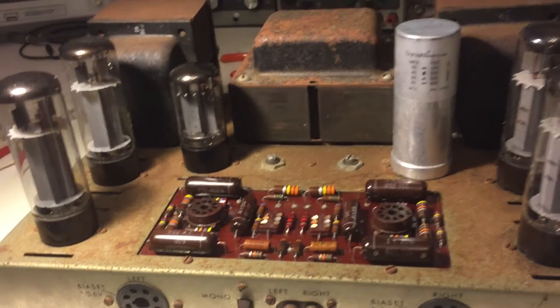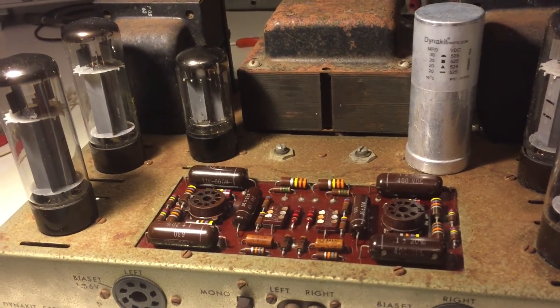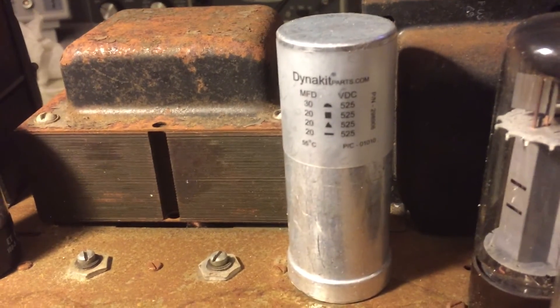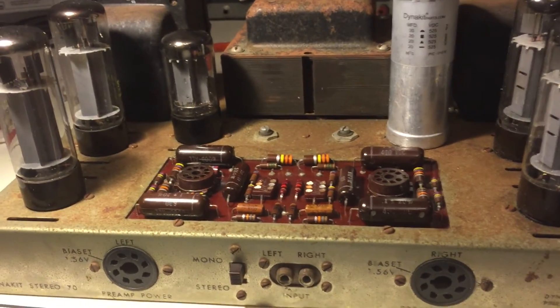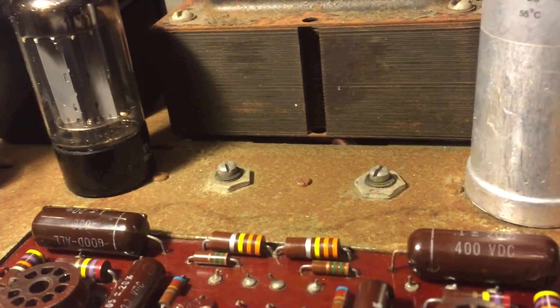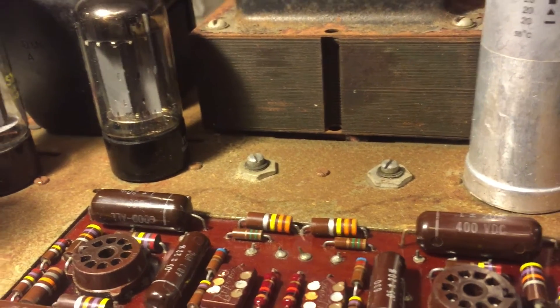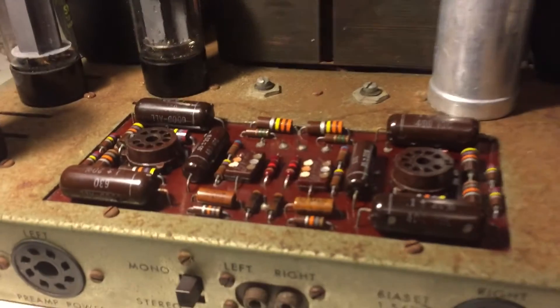At this point we've made all the repairs on the amplifier we need to make to get it working. It's surprising to see how little amount of parts needed to be replaced. Basically, what we ended up with was this multi-core capacitor, two electrolytic capacitors under the unit, two resistors, and that's pretty much it. I got some new potentiometers to put in here, but the originals cleaned up well — they'll go in the new case when it arrives. We're going to start our signal testing from the preamp portion, the phase inversion, and then outward to the EL34s.